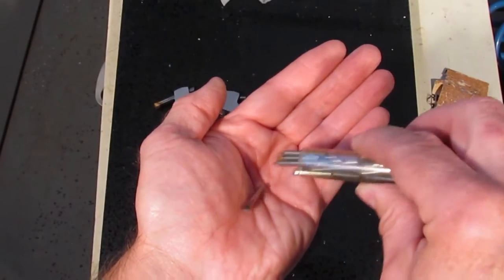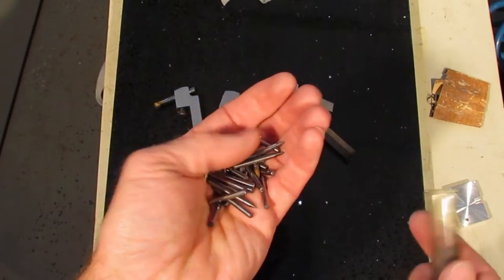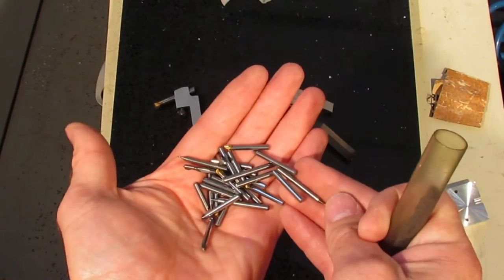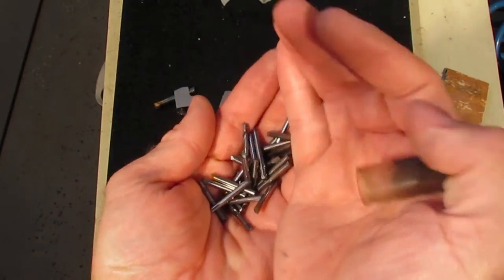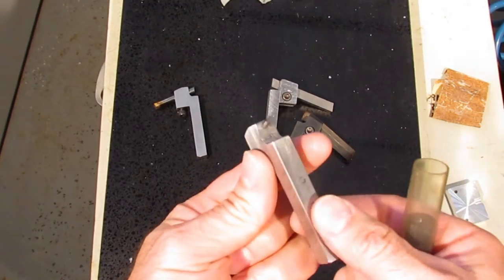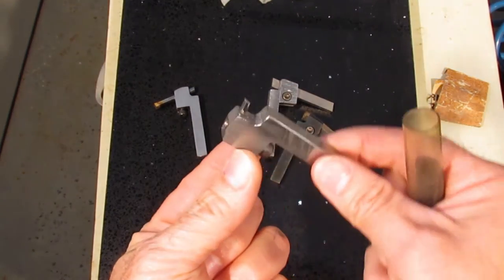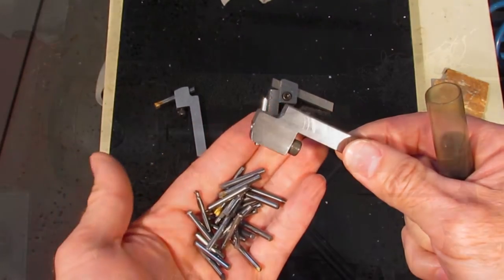Over the years I've collected a lot of carbide shanks from broken end mills and drills from mishaps. Thought it was a good time to put them to use, and tangential tool holders are a perfect way to implement their use. Tangential tooling is not a new invention. Seen many posts online describe them being available in catalogs since the late 1800s, but never seem to have caught on in the industry.